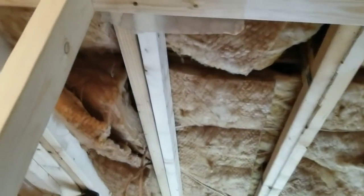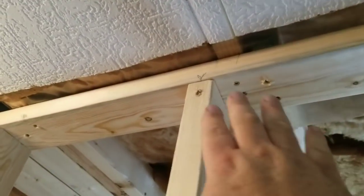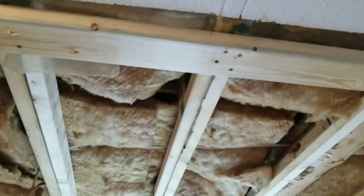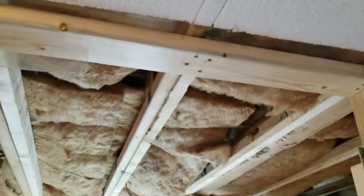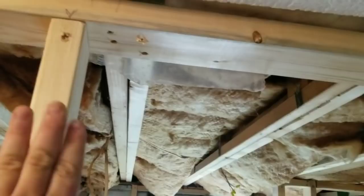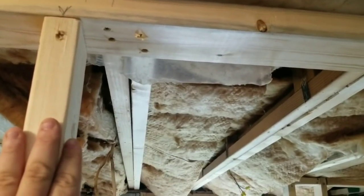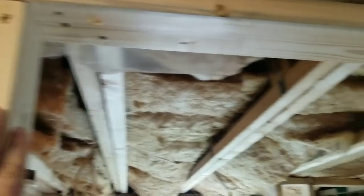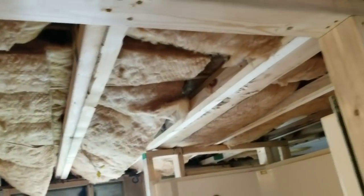And then when I have the wall drywall, I just wanted it to be able to butt up against something solid — so that's why that is. I'm going to go outside and see if I have a section of two by six, because I'm going to double up the two by six here and probably here and here. That way when I put out the barn door — those barn doors can be extremely heavy — I want to make sure I've got a good solid place to anchor those big steel barn door rails and rollers. So I'm going to strengthen this up quite a bit.